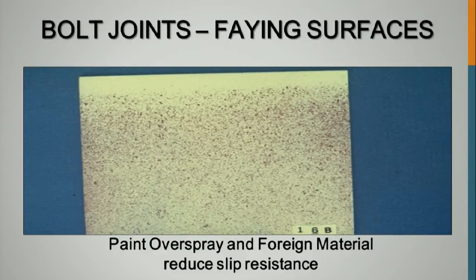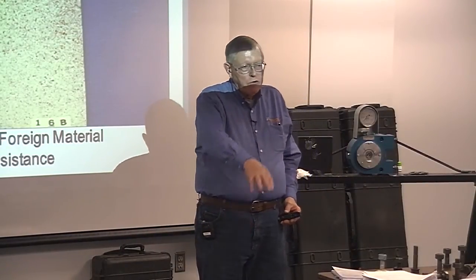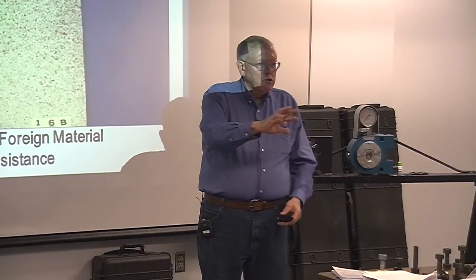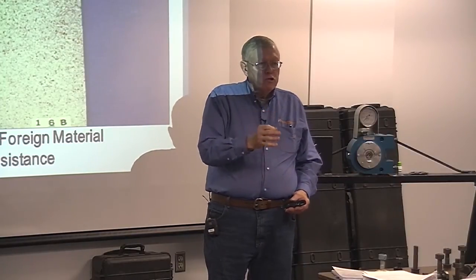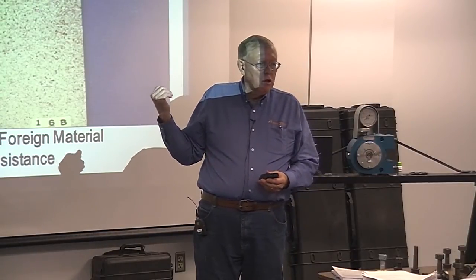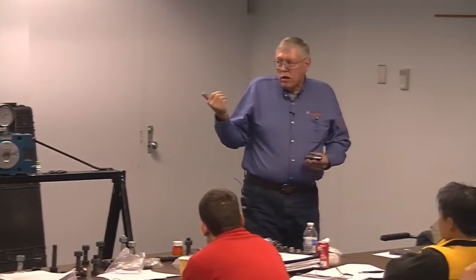But this amount of overspray, this amount of sand or dust blowing on a job, or have you guys seen steel girders being assembled on the ground? They set up a couple lengths of girders, they bolt a splice up, or they sit on the ground on some 12-inch timbers. They got the splice plates laying there and the dirt splashes up in the rain and there's some dirt on the structure. Clean that dirt off before those splice plates are put together, before they pick it in the air, because if this stuff is just sand and light grit between the splice plates and the girder flanges, whatever, that will destroy the slip coefficient in that connection.